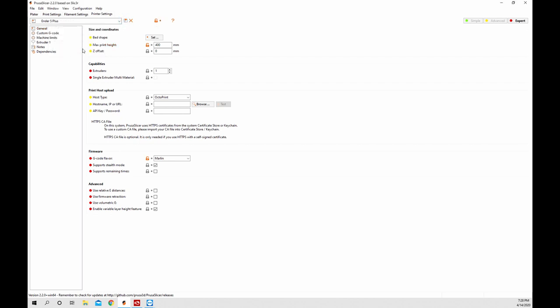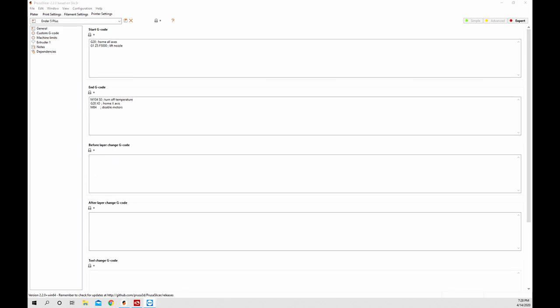Every section I do, I'm going to save by hitting the little button and clicking save. We go to custom G-code - this is where you add your starting and ending G-code. I'm going to add some custom start G-code because we need to add G29 for the Ender 5 Plus since it has the BL Touch. This is the G-code I use on all my printers that have ABL on them, and I copied and pasted it in. The G29 is in there. I'll also put that in the description below. I paste in my end G-code as well. So now my start and end G-code is in, and I'm going to save it.